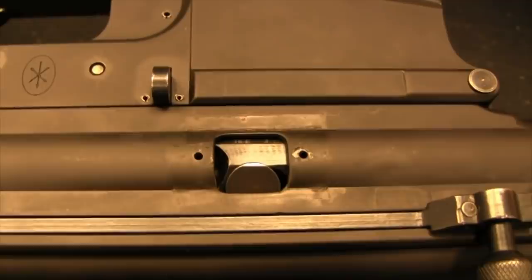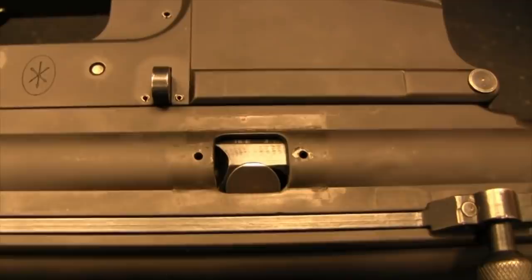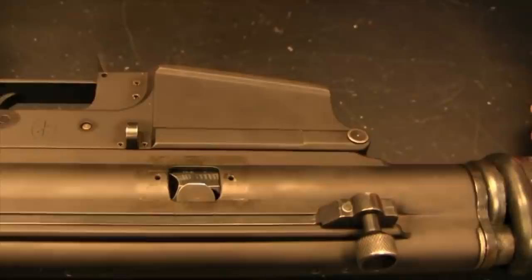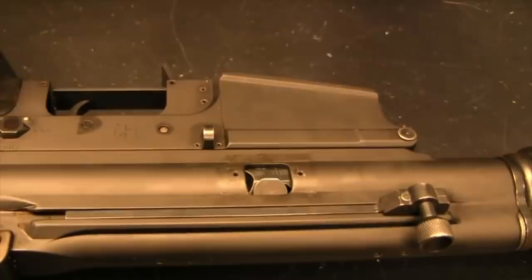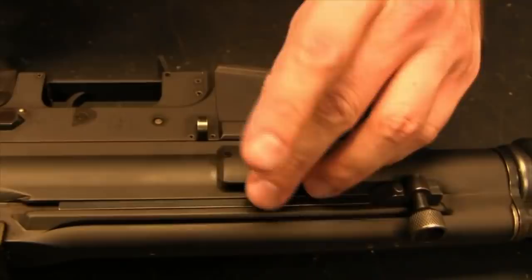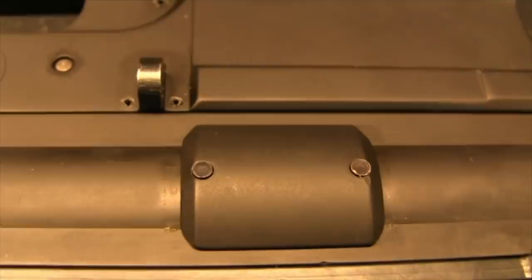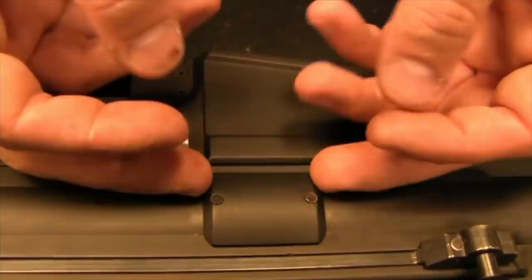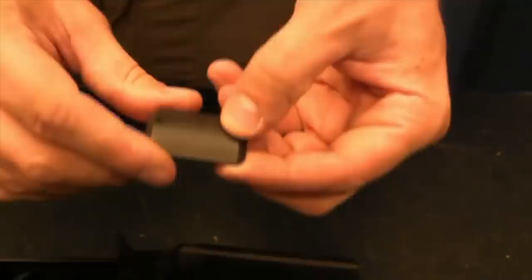On the left side of the rifle there's a big hole in the receiver where you can see the cam pin through it. That was a manufacturing issue — you need extra space in this tubular receiver for the cam pin. Most designs mill out a gap; Halloway decided it would be cheaper to just cut a slot in the receiver and put a cover plate on it. That was a good manufacturing idea and saved money. Unfortunately, the rivets holding the cover plate on have a tendency on many of these rifles to wear out and fall off — as has happened on this one.